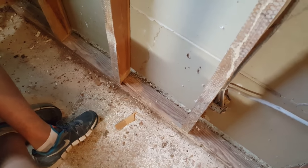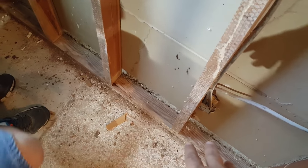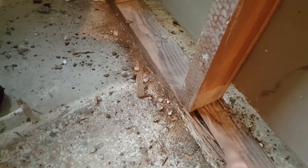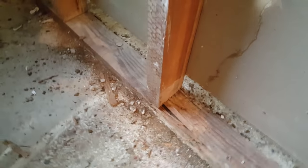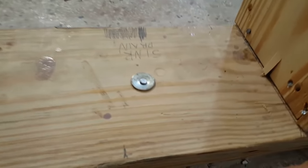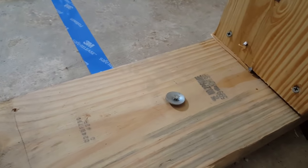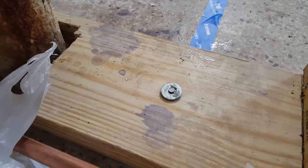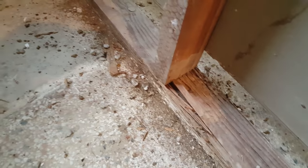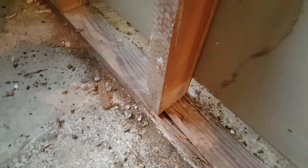What we have to do is start to remove the disintegrated material, and we also have to use the sawzall to get underneath these studs. Remember, there are nails pointing up into the studs from when they laid this down on the ground and built this wall. We got lucky here that the builder never secured this bottom plate to the floor — there's no anchor, no nail or anything. On the other wall you can see they were shot in with a nail gun, a Ramset. So over here we're going to slice underneath — probably two nails per stud with the sawzall.